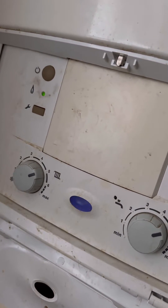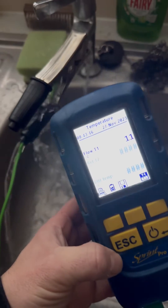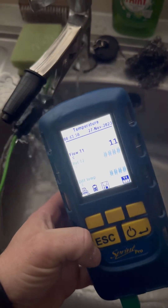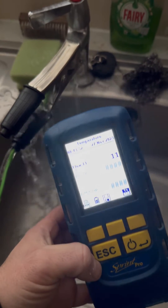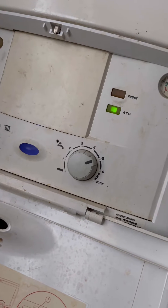Just like all breakdowns, we have to see for ourselves, so we don't touch anything — we just create a demand and see what happens. The boiler is firing, so the combustion side seems okay. But when you attach the clamp to the hot water tap, we can see it's only 11 degrees, even dropping to 10 degrees, yet the boiler is still firing.